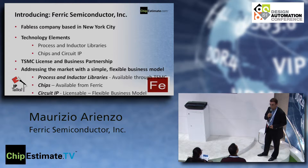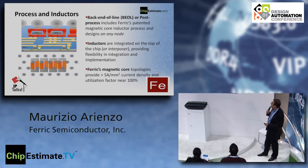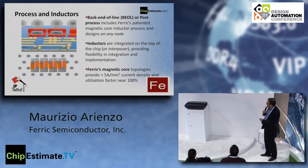This is a new device and new technology, and we expect it to be the fastest way to market for you. In the back end of the line at TSMC, after you're done with the top level of metal, instead of putting bumps we deposit this magnetic material, pattern it, put copper vias, and then a thick copper layer on top — two thick copper layers with vias in between. The copper is spiraling, and the gray is the magnetic material.